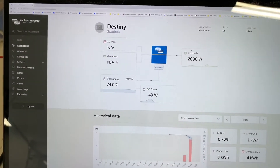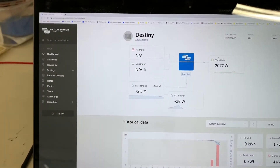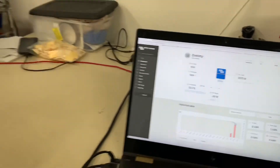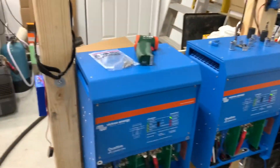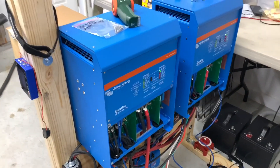What's happening here is just a load test — I'll post those results in the forums. I'm not going to do a special video for it. The AC loads were up to 9.5 kilowatts, which meant the battery was a little over 11 kilowatts, and everything was happy. Alright, thanks for watching.